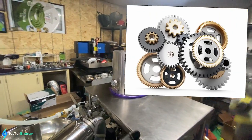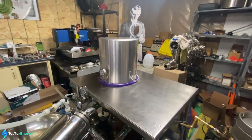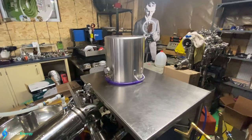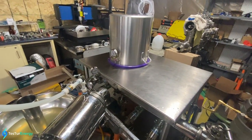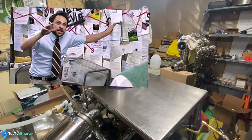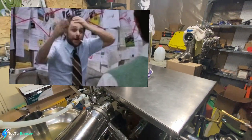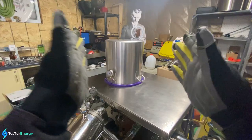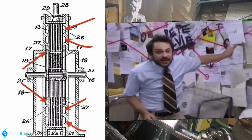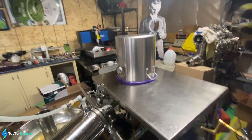I've got six bearings on the turbine itself on top of two bearings per generator — ten bearings total. If we switch over to direct shaft, you only have the bearings in the generator, so you eliminate six to eight bearings — all that friction becomes available power. The turbine casing also needs a lot of work: there's about an eighth of an inch of spacing on either side of the turbine end plates between the casing wall and end plates — that's really wide. There are no labyrinth seals or gland packing. There are so many places this thing can be made better for higher isentropic efficiency.